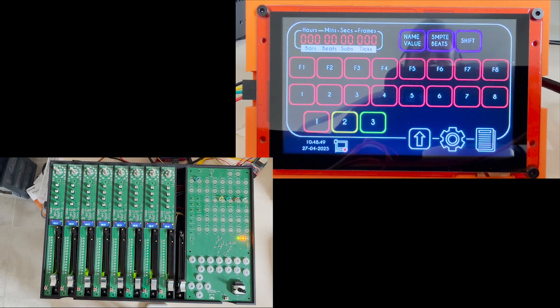What happened here is that after storing the downloaded software in a backup area inside the chip's memory, it restarted. The restart launched a bootloader — every MCU you will see in this process has a bootloader. The bootloader received a flag saying there was an available firmware update in backup memory, so it copied the new software from the backup memory to the main application area, then restarted again, cleared the flag, and launched the main application with the new software.